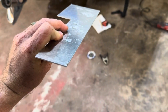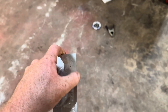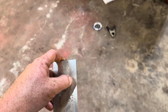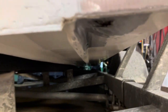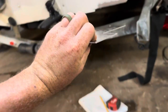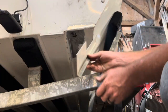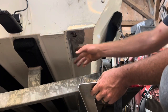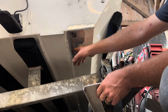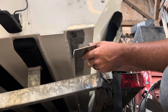Now we're going to blow this off, get all the water off of it, and clean up any burr from cutting. Then we'll take it out to my brake. About 9/16ths from this edge here, we're going to break it — I believe it's a 90. Let me check the boat again — yes, it's going to be a 90-degree break. I took the piece out to the brake, and before I did that I put an angle finder on the bottom and it was actually 80 degrees from the rib to the bottom of the boat. So I put an 80-degree bend on this piece of aluminum. Let's see how well it fits.